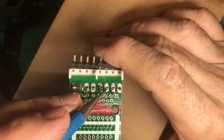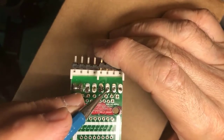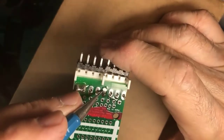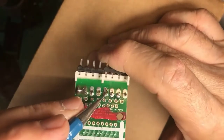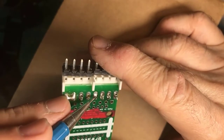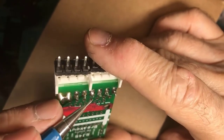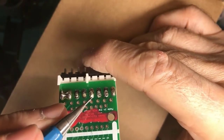You want to apply enough solder to fill the hole, because when it is full all around the lead, it is fully supported, so it's much stronger mechanically. This lead here with solder all the way around it is very solid. You can depend on the joint. Note the way the solder is nice and silver, and here's the tent shape that Chubb talked about. It flowed out onto the pad and up onto the trace, all the way around. That's what we're looking for.